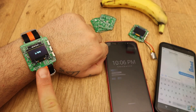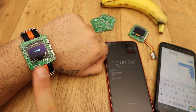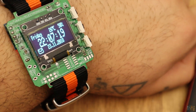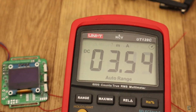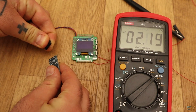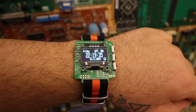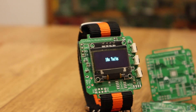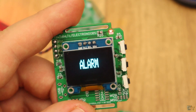That's it — this is how my smartwatch works for now. I'm working on a few improvements, such as placing a MOSFET on the VCC pin of the Bluetooth module. This way I could turn the Bluetooth off if I just want to use it as a normal watch and save power. With the Bluetooth module it needs around 4mA, and without it only 2mA, so that could double the battery lifetime. I will also implement a stopwatch. Once I receive version 3 of this board, I will also implement the alarm where the buzzer will beep for 1 minute when the alarm time is reached.